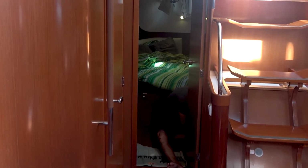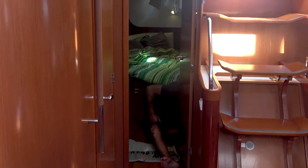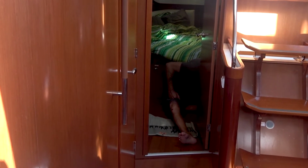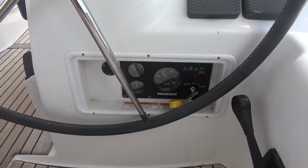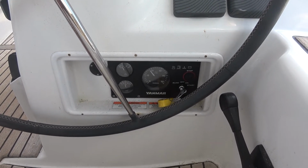Bingo. So this morning we are tackling Gargoyle's overheating issue. Right now there's two mechanics in the back and they are going to disconnect the transmission from our prop shaft and then see if they can do a load test on the transmission to see if it might be causing our overheating issue. It's been half an hour and we are still at perfect temperature.